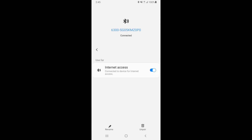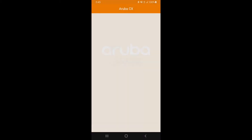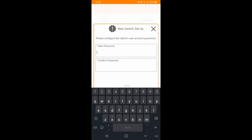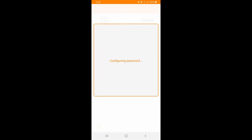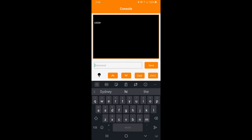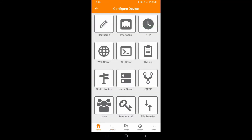On some devices, you will have to enable internet access through the Bluetooth. Now, open the Aruba CX Mobile app. Close diagnostics and usage preferences. As soon as your switch has been detected, the app will prompt you to set the admin user account password. Type in your password twice and click on Set Password. Once you're connected, you can access the CLI directly through the app or modify config through the available widgets.